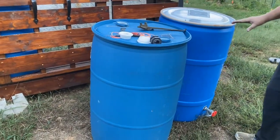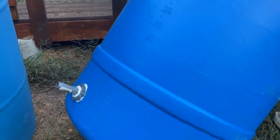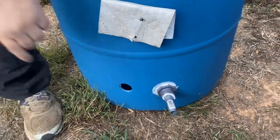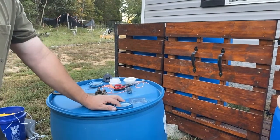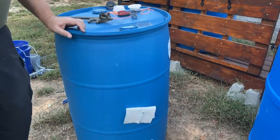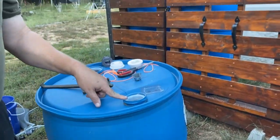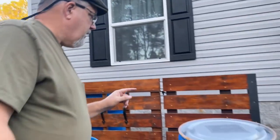We've incorporated both barrel types. Here's the valve, and here is the connection — we are going to connect all the drums at the bottom. The bung top creates some problems, particularly with putting the fittings at the bottom. Some people prefer open tops for that reason, but some people like bung tops because they can run the gutter right into the top through the nice round hole, which is easy to fit. There are advantages and disadvantages — I'll show you how to overcome the disadvantage.